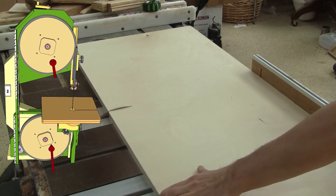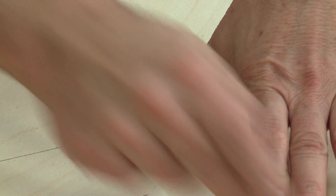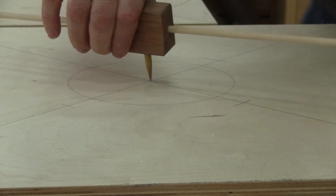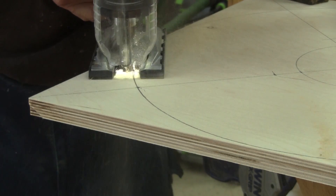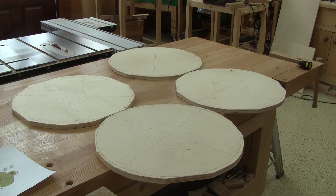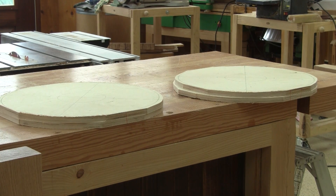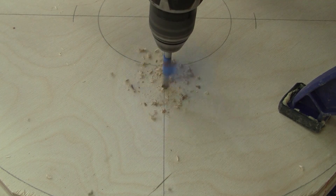The first thing I do is cut four square pieces of Baltic birch plywood for the wheels. After finding their center, I trace one circle to the size of the flange. I mark the position of the clamping holes and finally the outside diameters of the wheels. Then I roughly cut all the circles. This doesn't take too long, but right after, I make a mark on them so I don't mix them up, and it's a different mark on each one. Before drilling the clamping holes, I clamp the wheels together and drill them on the marks I did earlier.